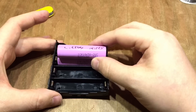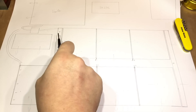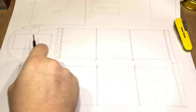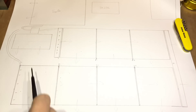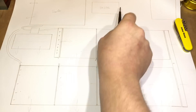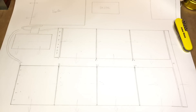I have made a plan. There are seven battery holders here with the positive end up and the negative end down, with a bus bar connecting the positive of cell four to the negative of cell five. A capacity checker will display the voltage of each cell or group of cells. The positive will have an inline fuse going to the Viewstar PWM solar charge controller, a DC-to-DC converter, and then perhaps a timer for the outside lights or space for other components.